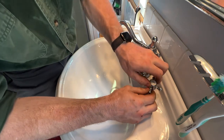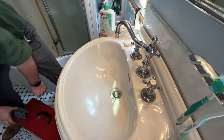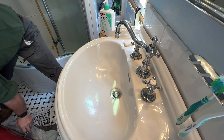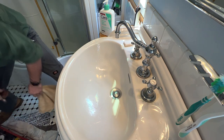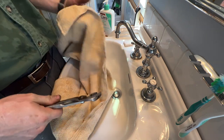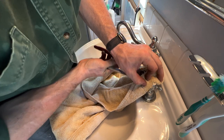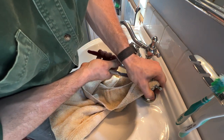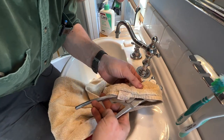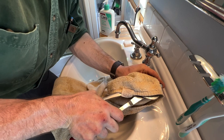I imagine that these tops spin off and there's a set screw under the handle here. It's a little loose. Some guys will just take the pliers right to it and then it'll jump and bugger up those knurls. So I usually like to take a towel or cloth, kind of put it over it. I can see one side of it — that way it kind of protects it a little bit from getting buggered up. There it goes, I don't have to put a whole lot of force on it.